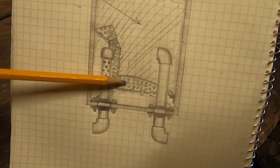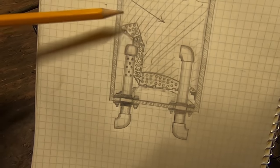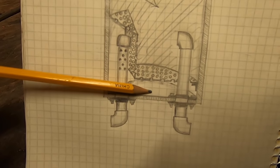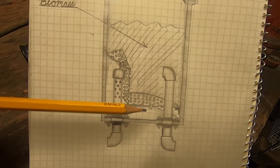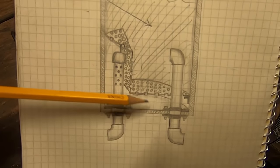You can see we have a grate that encompasses the bottom and also up the side, where there's a small grated capsule for the gas out. So we have air in here, the reaction happens around here, and then ash gets sifted to the bottom. So this is a passive shaker grate. This is why these are really only typical for vehicles or a device where the generator is mounted on the gasifier unit frame as well, so the vibrations can shake all the old ash down.